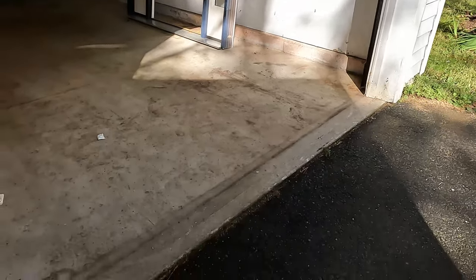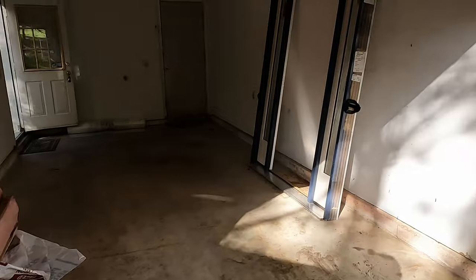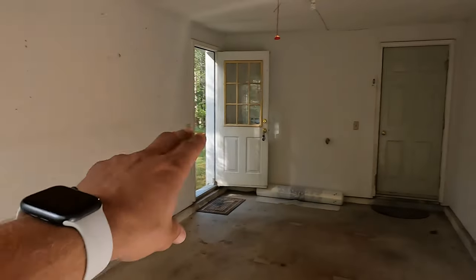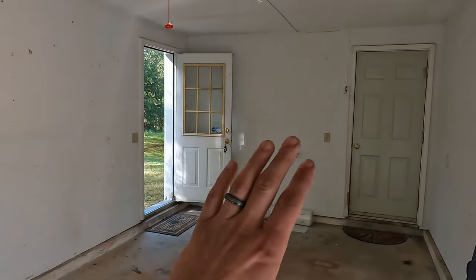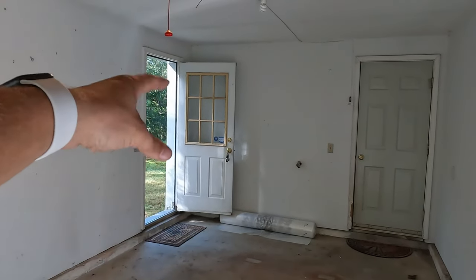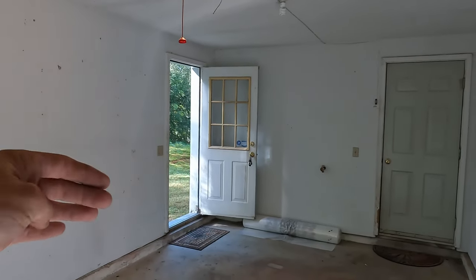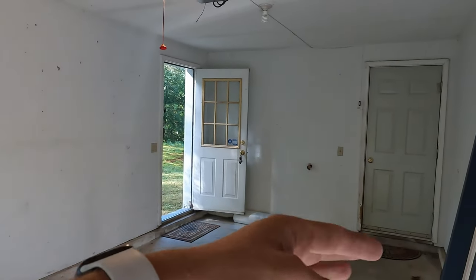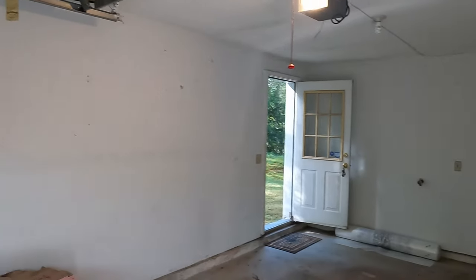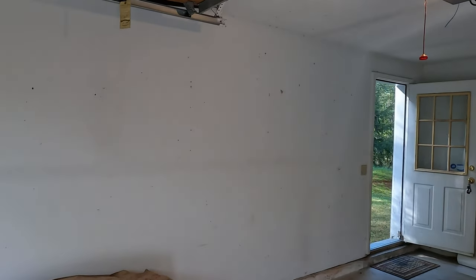You know, the water, if it comes down, rushing down here, I don't wanna have to worry about that. So we have that going in. And then over here is gonna be a bathroom tied in. There's a utility closet behind there. So we're gonna tie in a half bath down here. We're gonna put a window in that door so we don't have to build a new header, super simple. And then we're gonna build the wall obviously there, and that goes into the house. Over here, we're gonna put two additional windows to give them some nice natural light in here.